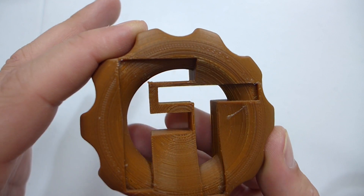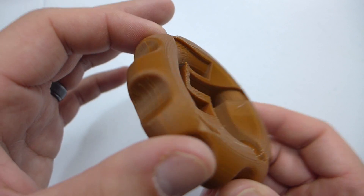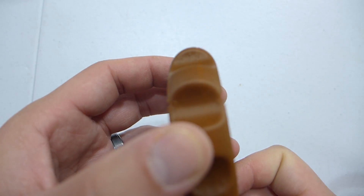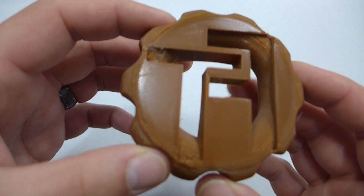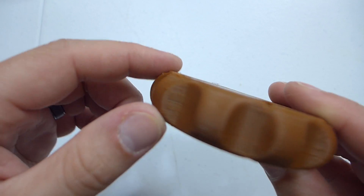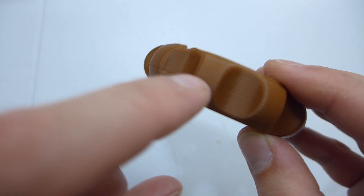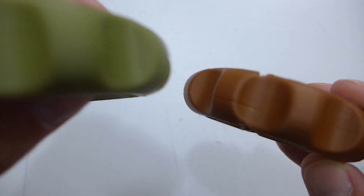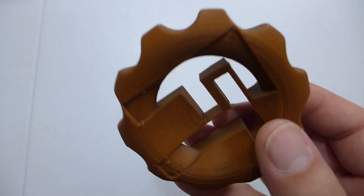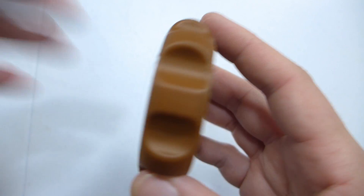Here's the chocolate brown PLA from 3D Solutech, also printed on the Hypercube. I've used their PLAs and TPU filaments before but never this color. It has a fairly matte finish with a couple of shiny spots on the top layers. The ultra base gave it a nice shine on the bottom with no peeling. Cooling was pretty good overall. There were a few under-extruded points in almost the same location as in the Segaden print — both printed on the same machine — so I'm wondering if it was a hiccup in the STL. Overall, an awesome print.